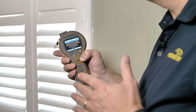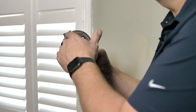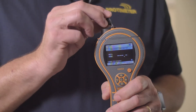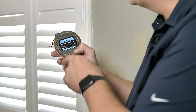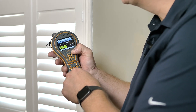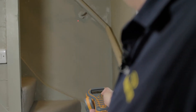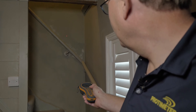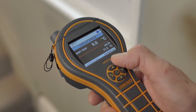Now we're going to use the moisture meter to determine whether we have condensation in this building. In order to do that we're going to use the non-contact surface infrared thermometer here. You can remove the rubber cap, press it once for the reading, and then twice to engage the laser pointer — now we're directed at the wall. You can hear the audible change immediately showing that it is indeed condensation, and we are 2.1 degrees below dew point on this particular surface.